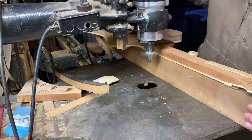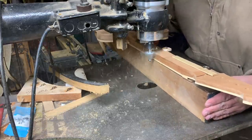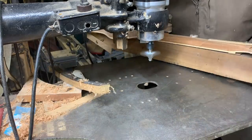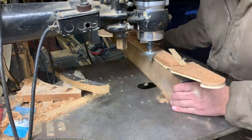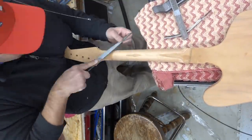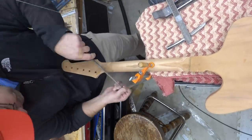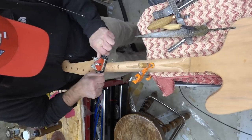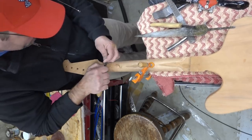For neck carving I've got essentially a one-inch bit mounted to a board. I stabilize that and run it through a couple of times, slowly lowering the bit so it looks perfect — it's a random sort of jig setup. That big fat board on the bottom really helps. Flip it over and do the back side as well. I think this was a '59 carve custom bit. Then we'll take this back downstairs to the basement and carve with a spokeshave and files. Since it's mahogany it doesn't take all that long.